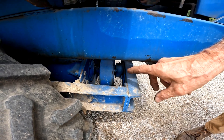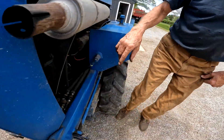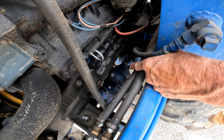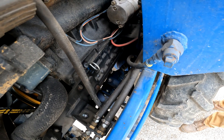Inside that chain case there's a number 50H drive chain which runs in oil, and there's a pilot bearing — a ball bearing — to support the end of the shaft. On the other side there's a Cessna hydraulic motor with a variable pitch swash plate. These are not real common but they're a real nice thing to have — it gives you almost like an overdrive gear.